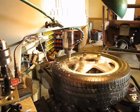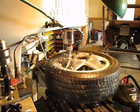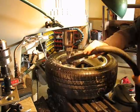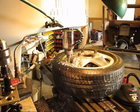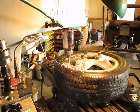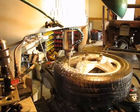If you're wondering, this mill I've got is too small to do the whole rim at once, so I've got to index the wheel. I made a fixture that I can index — you see the four bolts on top there — and I can index it five times just by using the different bolt patterns I have in my fixture. After it gets through milling here, I'll show you spinning it from the first to the second hole.